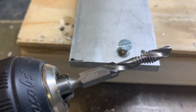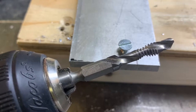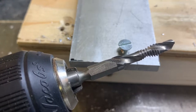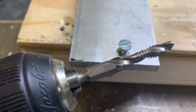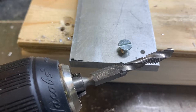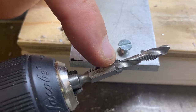Testing the Milwaukee quarter-20 drill and tap bit, all in one. I have this in a Ryobi cordless drill, also made by the same people who make Milwaukee. We're going to try this out in a pre-drilled hole just to save a little time. I have done it blind with good success, and then we'll go through that and do a little bit of the countersinking that's included on the tip or the base of the bit.